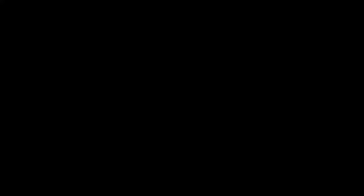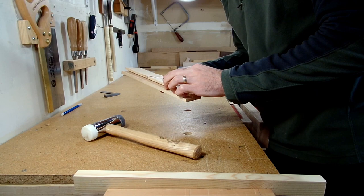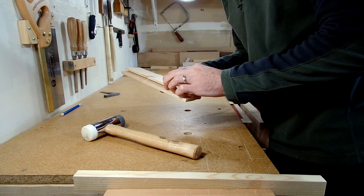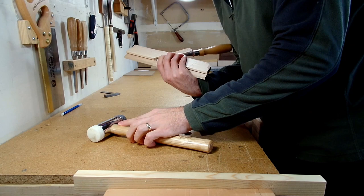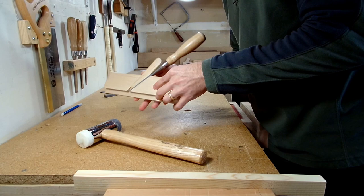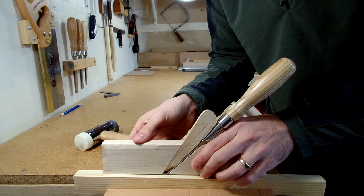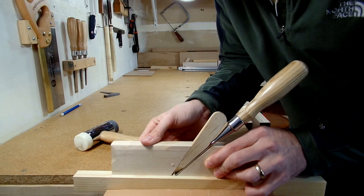To use the plane is pretty simple. First, I need to set the chisel — I place the chisel so that it is just barely sticking out and then tap in the wedge to secure it in place. I then run it along the wood to see if it's cutting or not. Sometimes you get lucky and get a cut right away, but more often than not you need to adjust how much blade is protruding from the plane. I hit the chisel to advance the blade, and then hit the wedge very hard, which not only securely locks the blade in place but also retracts the blade some. I keep doing this, looking down the plane to see how much blade is advanced, until I feel like just the right amount is sticking out, then I take it back to the piece of wood and see how I did. This time I got it just right and can now continue cutting my groove. All I need to do is keep cutting, ensuring the fence is being pressed firmly against the wood to keep the cut parallel. And there is just something super satisfying about seeing those nice long shavings come out of the plane.